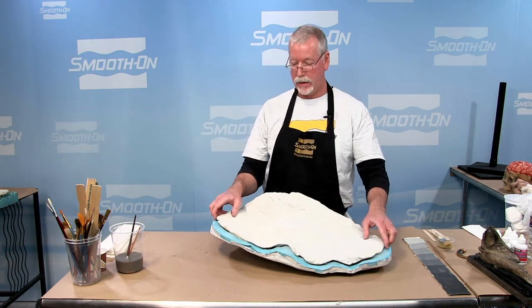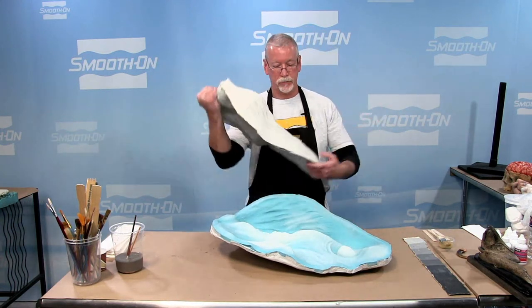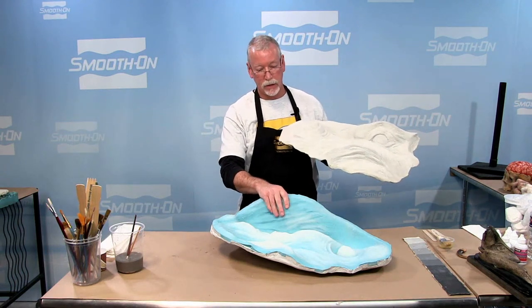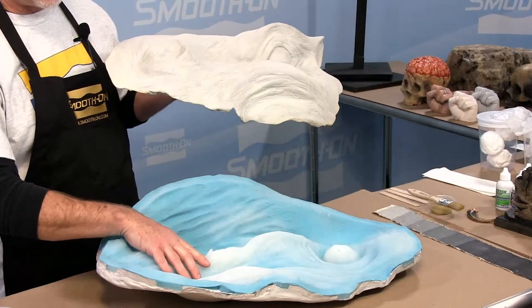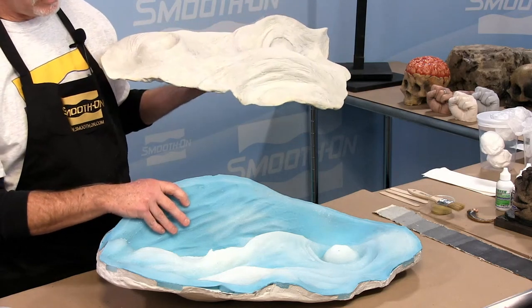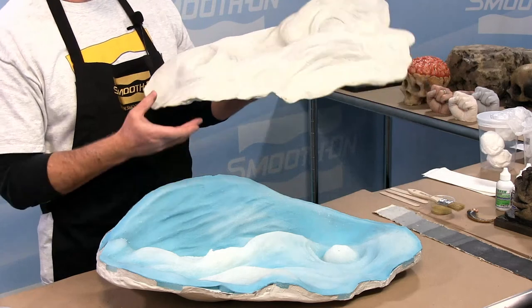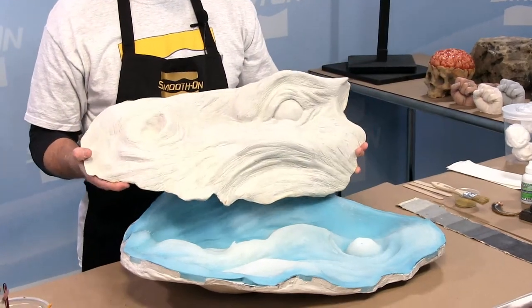Freeform Air. Then that material was pressed into this mold, and this is a silicone mold. I actually used platinums. I didn't want to waste it, so I had some Dragon Skin I used, and I used some Mold Star 16. They're both platinums, they're compatible, and I didn't want to waste any material. So this particular piece, I was very happy with that.